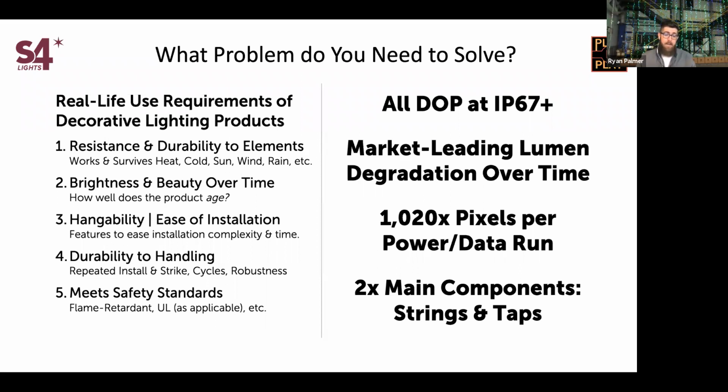So I'm happy to go into as much depth as you'd like if you get me on a call with your rep, and explain why this is important. But the first number, which we're talking about here, is 6. 6 relates to dust tight. There's no ingress of dust. 2 to 8 hours of bombardment, and you're not going to have any particle ingress at all of dust. If we were talking about 1, it's protected against a solid object greater than 50 millimeters, such as a solid hand. So if you see IP ratings in the 10s, it'll keep out something as big as my hand. 6 is something as small as a particle of dust.